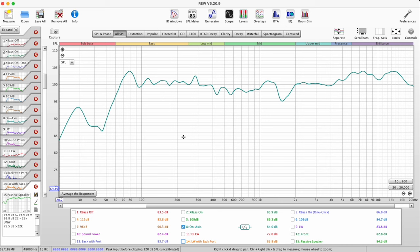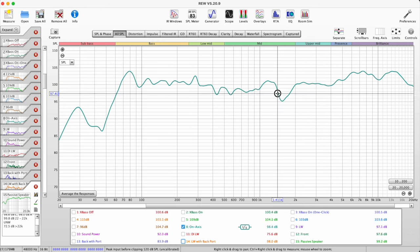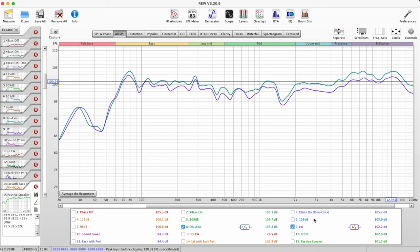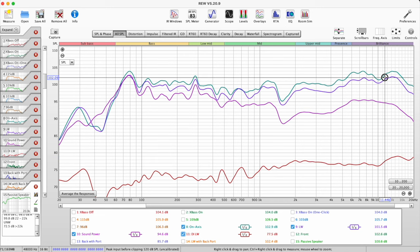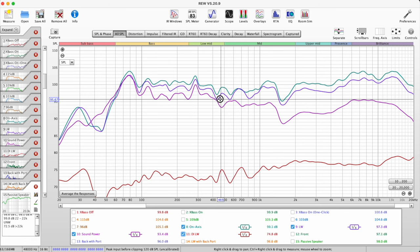This is an in-room measurement of the speaker. Looking at the on-axis response, the first thing I'm seeing is it is slightly V-shaped and there is a dip at the crossover. This is what people refer to as a BBC dip — it helps with directivity but it's not something I usually prefer. The treble response is a rising response. Looking at the listening window, you can see it follows the on-axis response pretty well. The sound power response and directivity index show that everything in the upper region looks smooth, which means that region is EQ-able, but there's more going on in the lower region that I may not want to EQ.